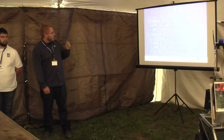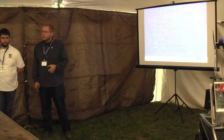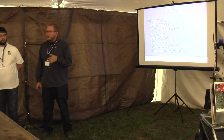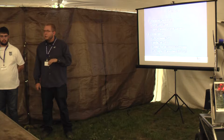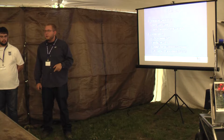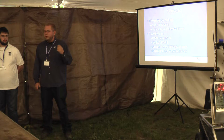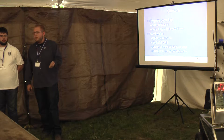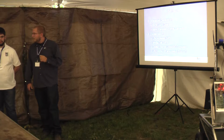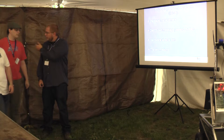The other would be localization. We're using 2 off-the-shelf USB GPSs, an Ocean Server Compass, which is also giving us yaw and pitch, and 2 digital encoders on the motors, which are 512 clicks per rotation, so we're getting very high accuracy on it. So to talk about our software architecture.